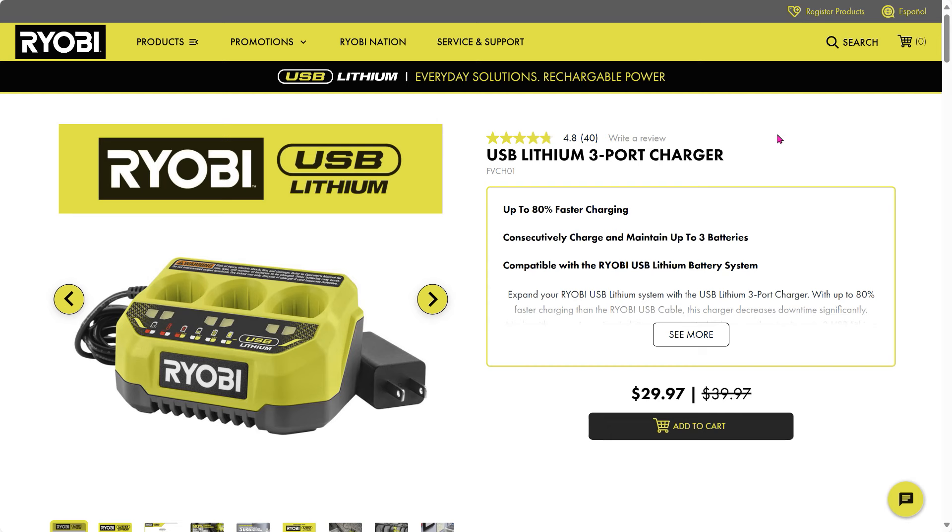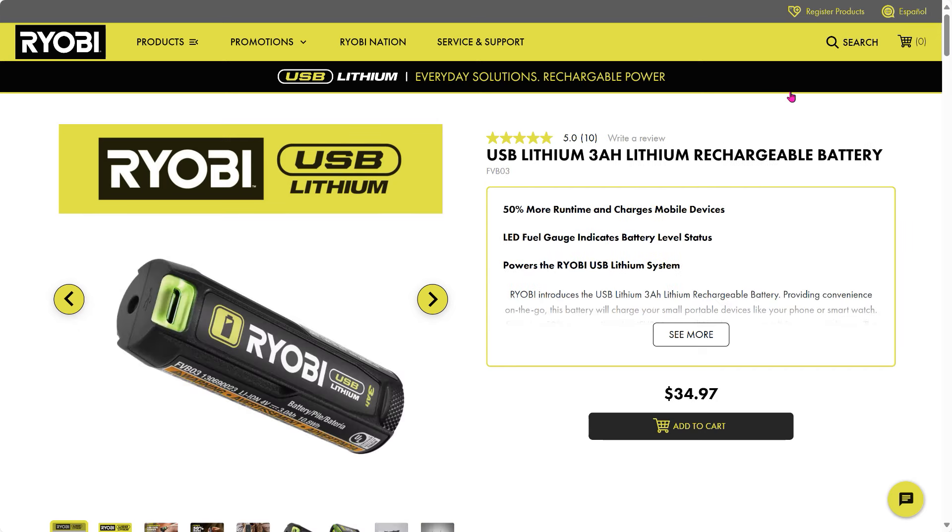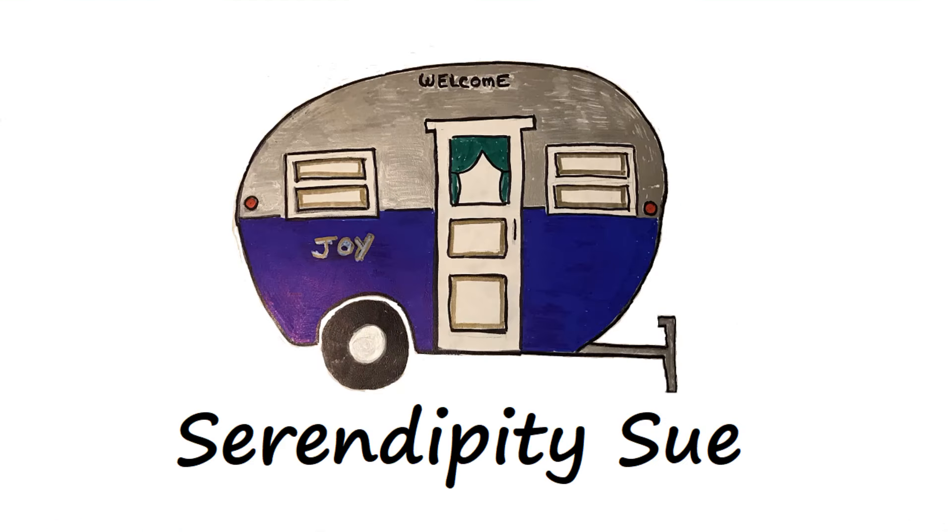I know we just went over a lot of data, but the main takeaways are: it is faster charging with the 3-port AC adapter; we can hack it to run off 12 volt cigarette lighters and Type-C ports; and the Type-C port can be charged and discharged at about 1.35 amps. I put all the things I used for testing in the video description. I hope this hack was helpful along with all the test results — if it was, please hit like and subscribe. Have a great day!